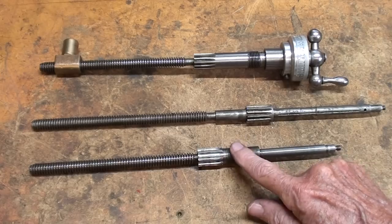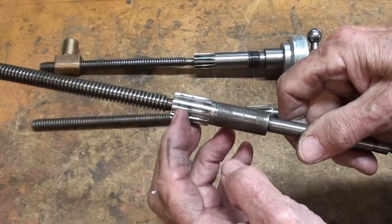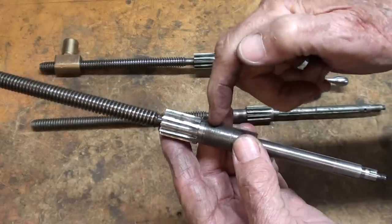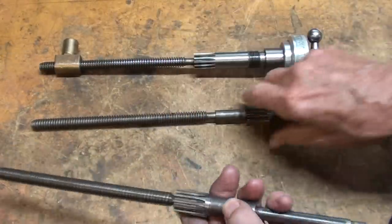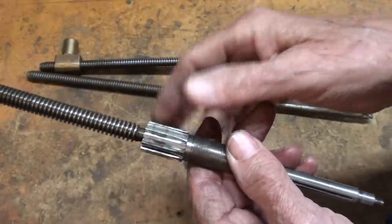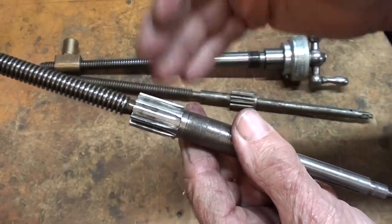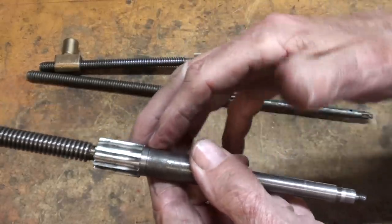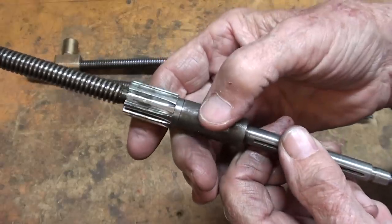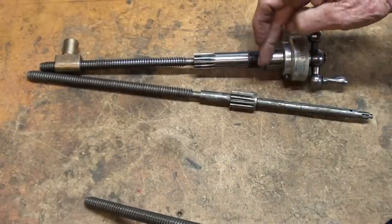This is the original one that came from Florida. I made the gear in that video, and it's held on with red Loctite. People said I should have used green Loctite, but it hasn't slipped on me. Others wanted me to pin it — well, pinning it reduces the strength of an already rather small diameter, and I didn't want to weaken it. Others wanted me to braze it, silver solder it, or press fit it. Press fitting with an interference fit is not all that easy because it is so easy to make a mistake, and then you can't get it on all the way or it's loose. Then you might as well just use the Loctite. A lot of criticism, probably well-deserved. But I'm taking this out of service and installing the correct one.